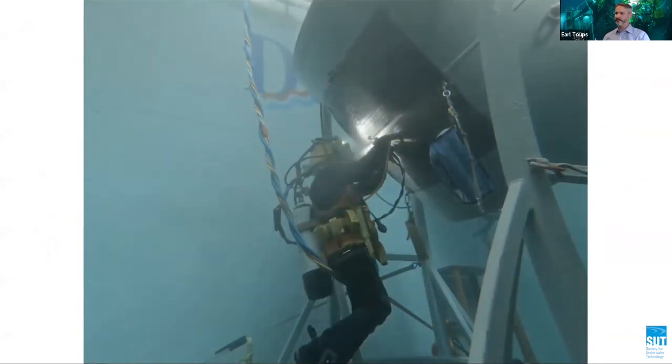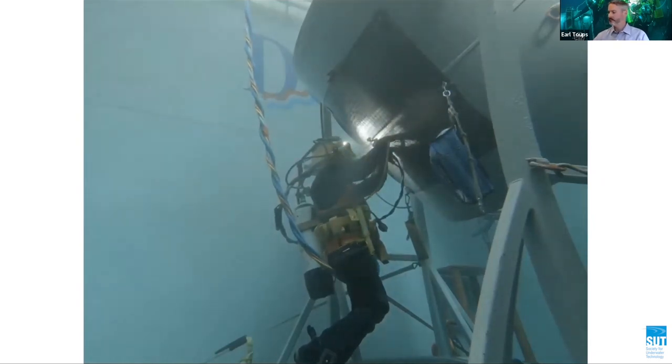Faced with this prospect, I explored alternate methods for excavation of the weld defects and came up with the notion of using hydrocarbon arc gouging. I was extremely familiar with air carbon arc gouging as it was commonly used for making pipeline weld repairs on board the lay barges. Once we devised a makeshift gouging torch, we trialed and tested the process in our test tank under simulated conditions we expected to see on site offshore.